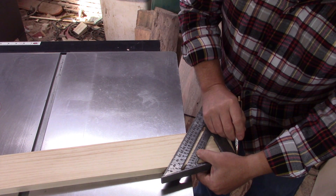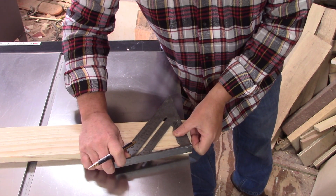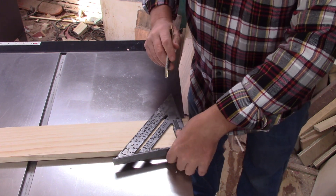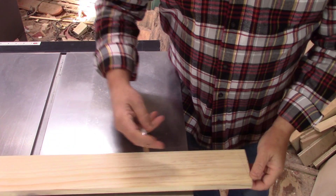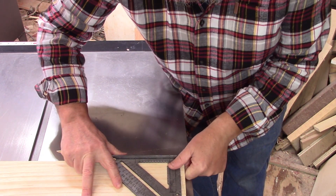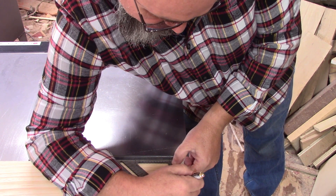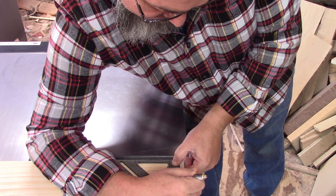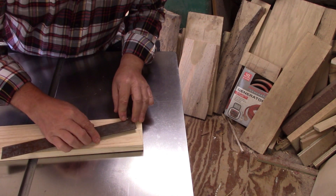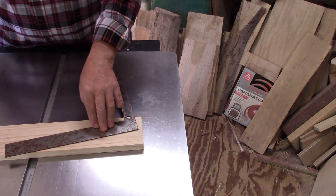Getting started off, I decided to give my ladder 10 degrees of lean. I just use the protractor on my speed square to get 10 degrees. It's very important you get the bottom and the top parallel — 10 degrees at the bottom, 10 degrees at the top. I've marked the back, and I know that I'm going to have to cut a line that will come straight down the wall. I decided to start at the center, and that's what I'm marking off here — just marking off the center of my cut line.